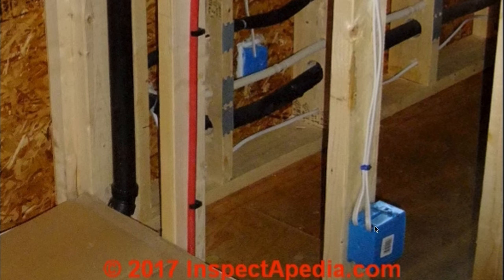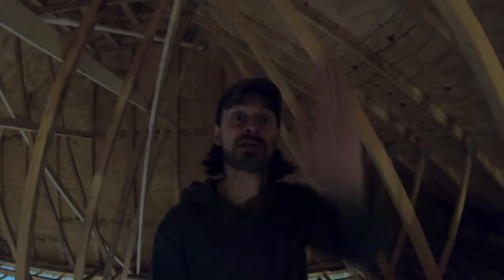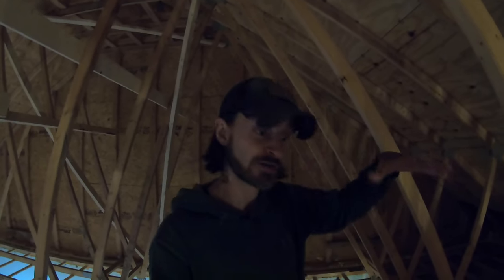If you go ahead and move some of your insulation away and you see a big old half inch hole with your wire sticking up through there, again, your light switch or your outlets, those are not airtight. You're gonna shoot air right into that box. It's gonna go up through the box's hole where the wires are coming in, and out the sides, because they all have pre-cut tabs that you can smash down and bend out, and those are not air sealed. So once air shoots through your outlet or light switch, it goes up through your cavity, straight up through your top plate, and then it's up into your insulation. And if they don't have good insulation up in their attic, you will actually get ice forming and mildew, water, precipitation, etc., trying to come out through your outlets.